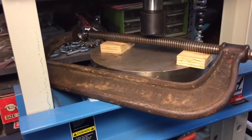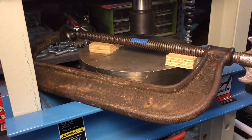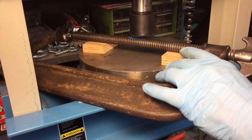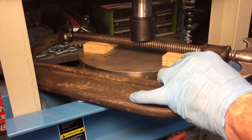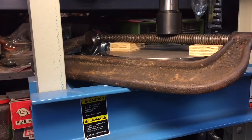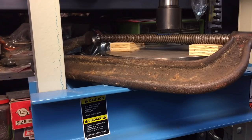We're over at the dake press. We've placed the shaft between two blocks of wood, and we're going to put the ram under the high spot — I marked the high spot with a piece of tape. You can move the wooden blocks back and forth to get the right pressure in the right place. We press it down a little bit, and once we make contact, we look to the side to see the bend. We apply about a ton of pressure, not a lot, then bring it back up and check it. This is what we do — back and forth until we straighten it out.